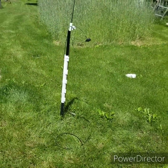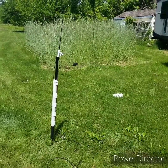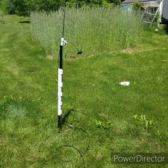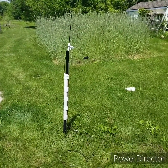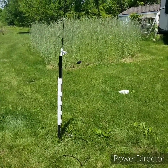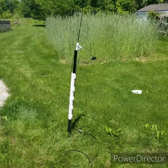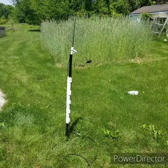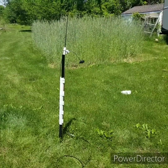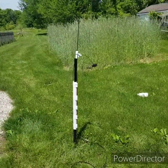I can put this thing up in way less than ten minutes. It covers all bands, doesn't have any feed line losses. You don't have to worry about tuning it — you just have to have an antenna tuner at your radio. Using a doublet takes care of a lot of problems you'd normally deal with using loaded antennas or tuned dipoles. And you've got the right counterpoise automatically with the second leg of the antenna.